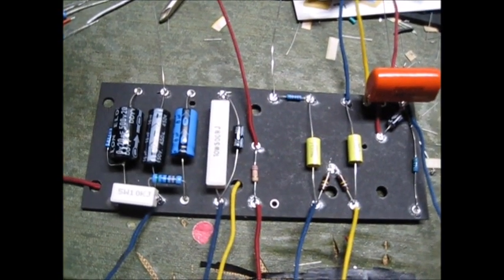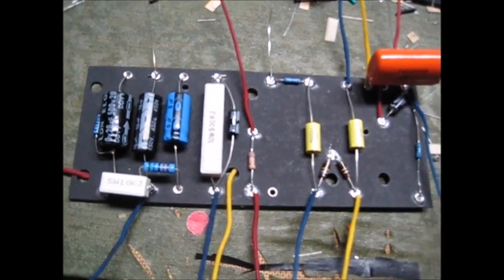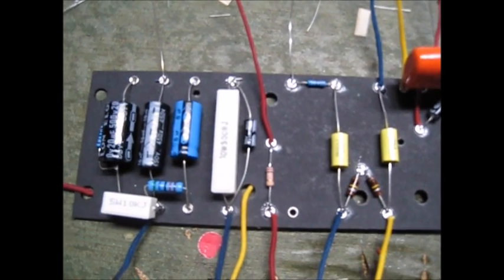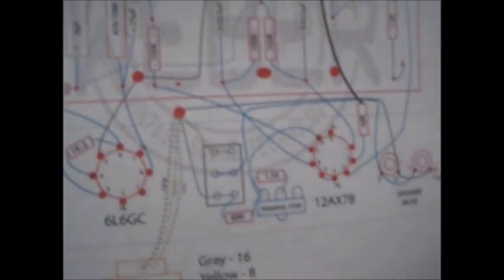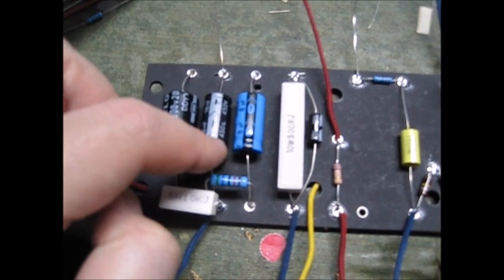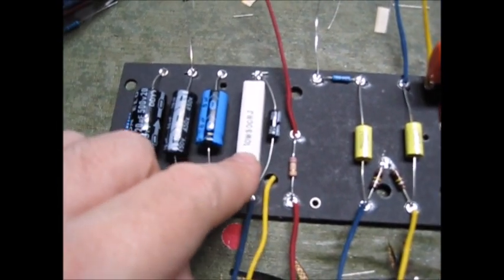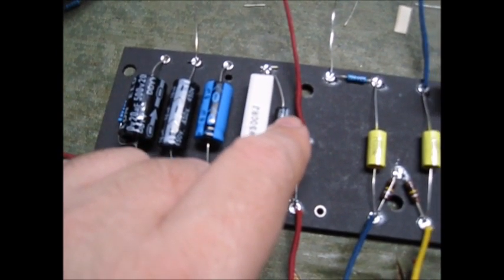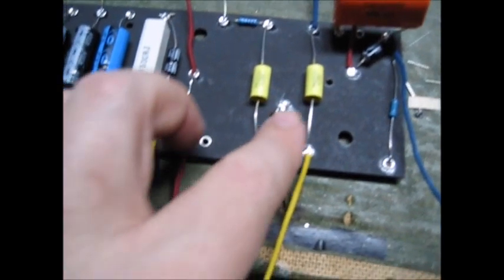Things that go to ground are the naked wires - got three naked wires - and there are some linkages under there where two caps tie together. The values of these caps are actually the ones on the schematic: 20 and 16. The 16 has two dimples in it so to find the negative you've got to trust the arrows. They went with a 500 ohm resistor - there's a 500 on the schematic, 470 here. The 25 microfarad is actually a 22 microfarad; 22 and 25 behave close enough. The 0.47 is physically massive, and there are 0.022s.